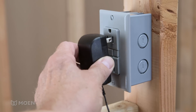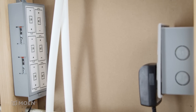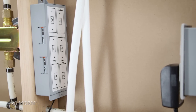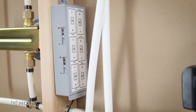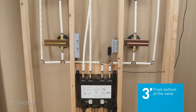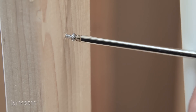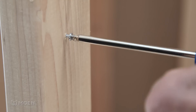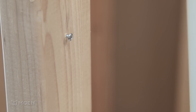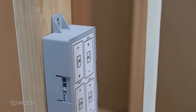Plug the other end of the AC power adapter into the electrical outlet. An optional battery backup is available. This allows homeowners to use the shower for a few days without AC power. The battery backup should be installed above the valve but within three feet of the bottom of the valve. Install the provided hanging screw at the proper location, leaving an eighth-inch gap from the wall. Insert the 6D alkaline non-rechargeable batteries that are provided in the kit. Hang the battery backup on the screw.